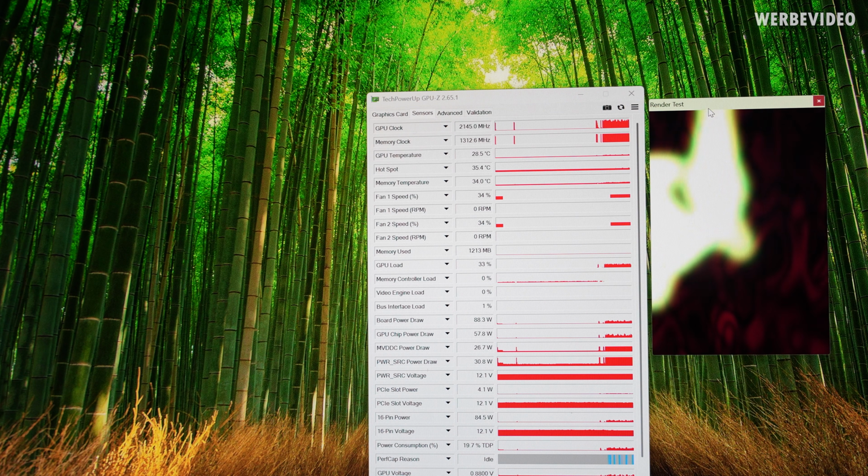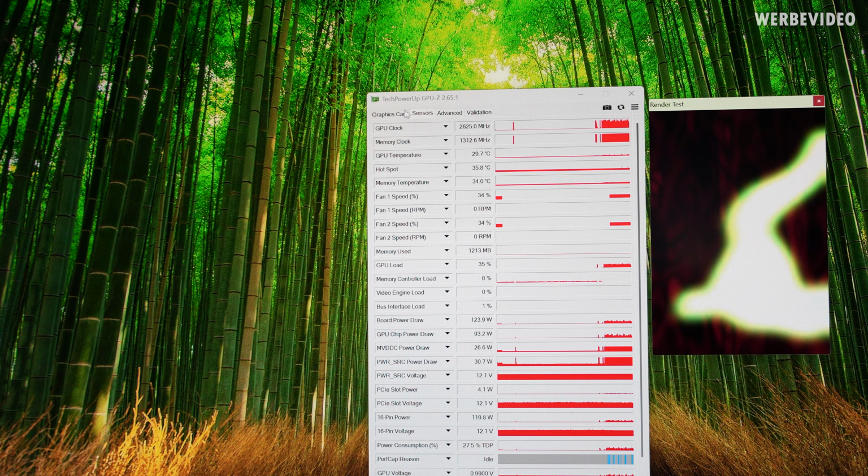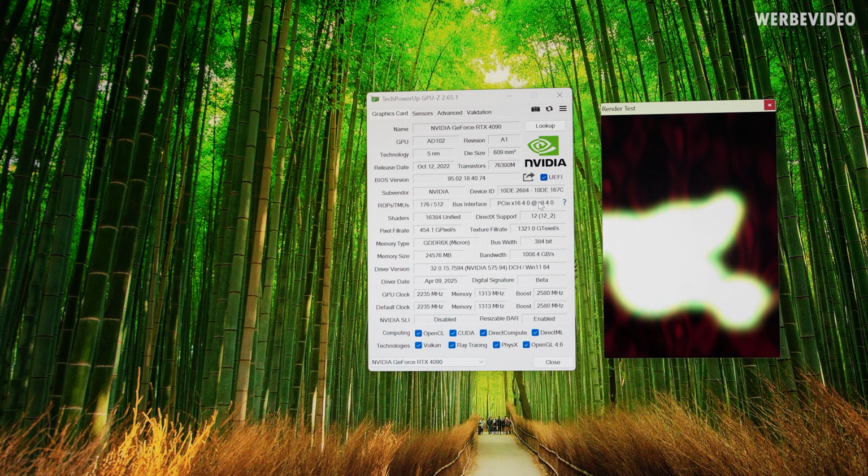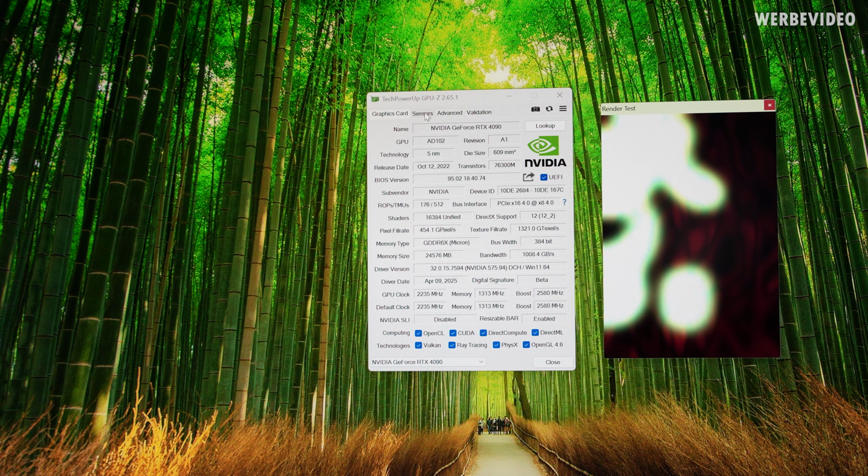And with a different GPU, I always have X16, so it has to be this specific card. It shouldn't be a great performance loss. It's something you can definitely notice in a 3D Mark, but for gaming, I think this should still be okay if it only runs at half the PCIe lanes.